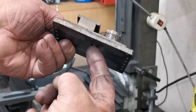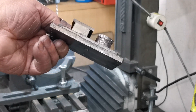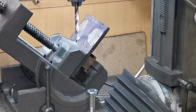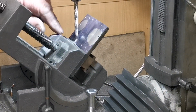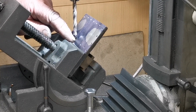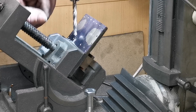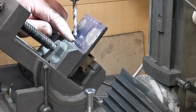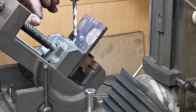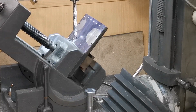Right, I've got this set up at an angle. What I've done is put a small end mill in and created a small flat in that hole, then I've used the centre drill. Now I'm just going to try and go through — hopefully I don't muck it up, just keep my fingers crossed.